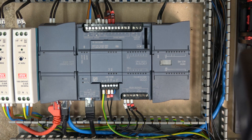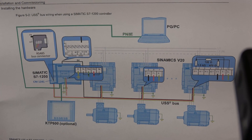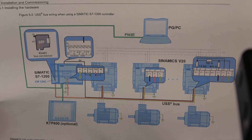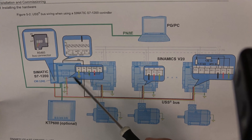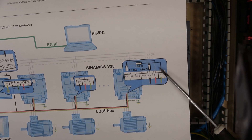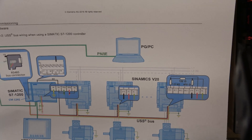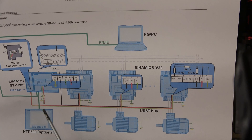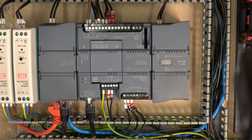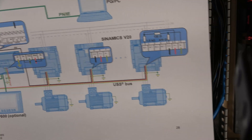We're going to be following this wiring diagram, which will be in the description below. If you are new to RS485 connections, you only really need two cables to communicate. You can see TB and TA connected, plus earthing. At the end of the bus, if you have more drives, you have a bus terminator. It is recommended by Siemens to have it, as they've safeguarded you from issues with the network in case of EMC interference, which could cause your line to drop.